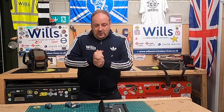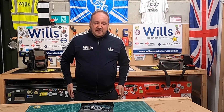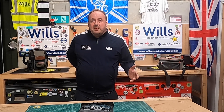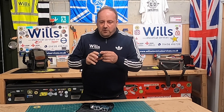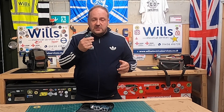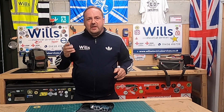What I found handy with these is: if I've just finished a new job and I've come in to test it — doing all the dead tests — and I'm looking for my R1+R2, or R1+Rn, these are really handy. I'll use the example with the GU10s — if you plug these into the light fitting, when you finish the whole job and come to test and commission it, they're great for dead testing.